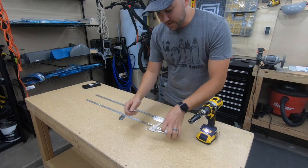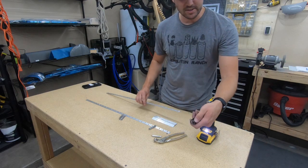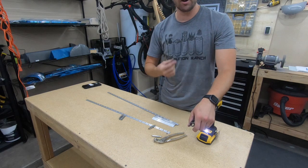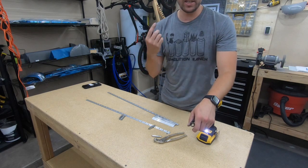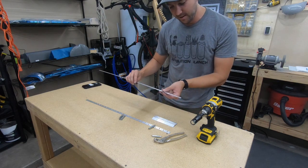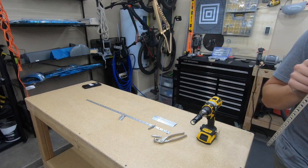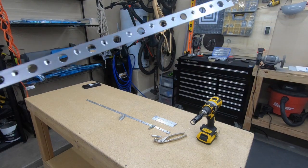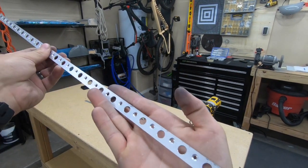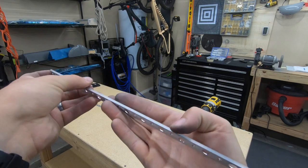It also prevents the chattering, so it's very, very common for me at least to have this countersink cutter want to chatter when it's not a solid surface that you're working on. Once that chatter starts, it really can just eat up the material and make it look ugly. So every once in a while, you'll still hear a little bit of a chatter, but I think it leaves a really nice surface, a really nice countersink. So let me see if I can get this in frame. But you'll see here, they're all really, really pretty countersinks, and they're just the right amount.